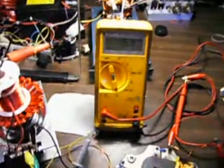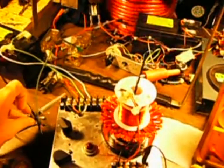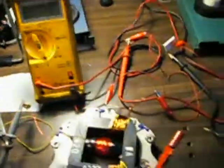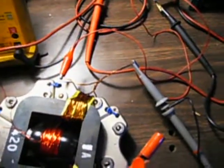So we've got like 1300 volts kicking over there. But this transformer will do a step down. So what I'm going to do is kick channel 1 over to AC. We're at 50 volts per division. I'm going to pull that trace going out to our charging battery, and I'm going to connect it up over here so we can measure the voltage at our transformer output. Now that's what's in series with the 1 ohm resistor right there. Okay. So let's kick it over to channel 1.